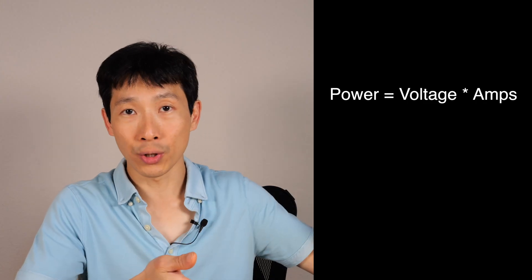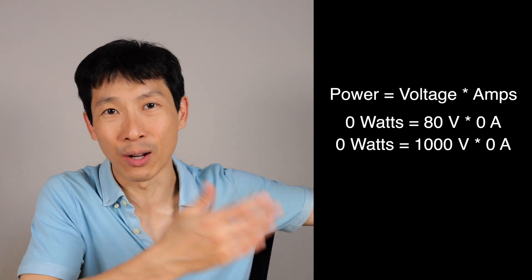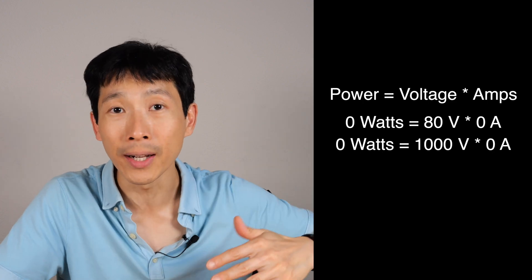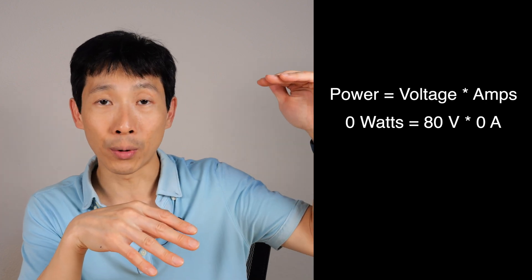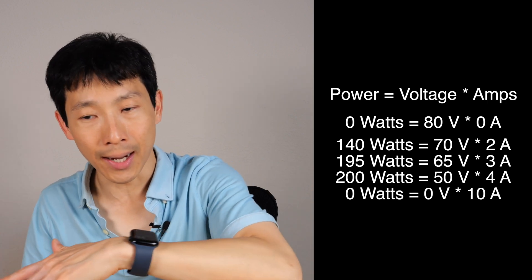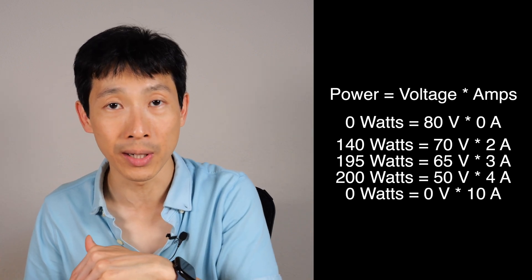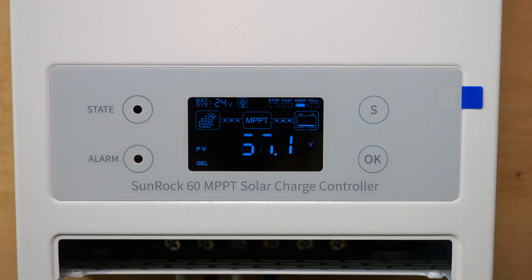Now we can think of solar panels as something similar. I have four 100 watt solar panels and the open circuit voltage is around 80 volts or so. Power is measured by the voltage times the current. Open circuit voltage means there's zero current, so you can have solar panels at a thousand volts or whatever volts, but if there's no current flowing, there's no power transferred. But as soon as you put a load on it, that voltage starts to go down and down to a point where if you short circuit it, it's going to get very close to zero. In that case, there's also very little power transferred.